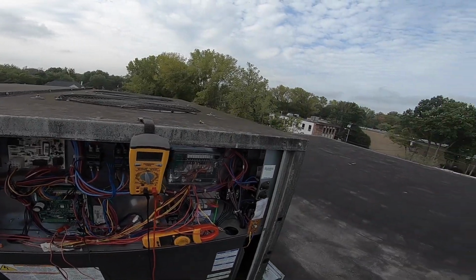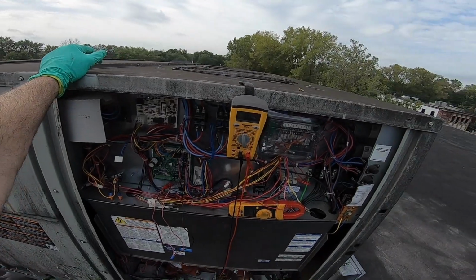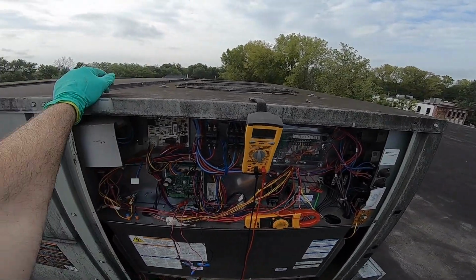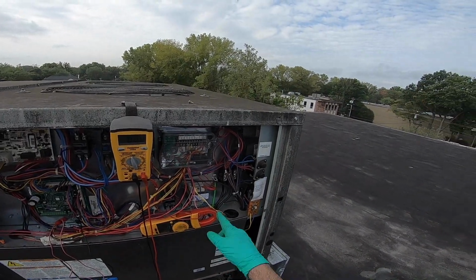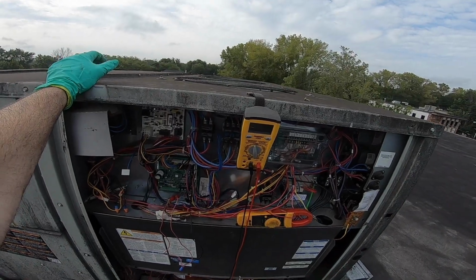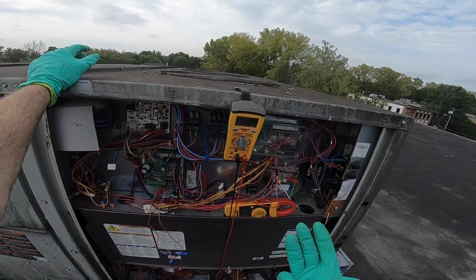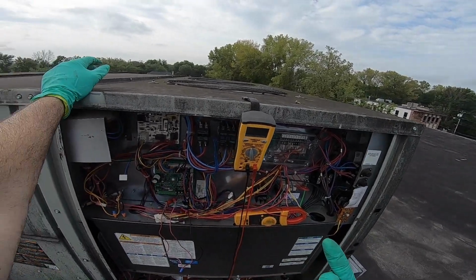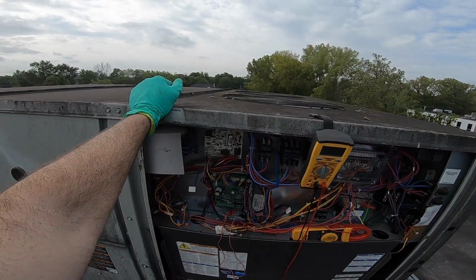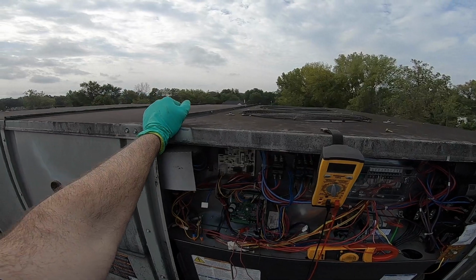0.5. One of my coworkers was working with me. He still works with me from time to time. But when he was first starting off, I asked him to lower it to the 208. And he ended up, unfortunately, moving the common over, blew a fuse. The breaker was destroyed. And it was a special breaker. It had like three different things on one breaker, almost. We had to really hunt down that breaker so we could swap it out. That's two successful starts.